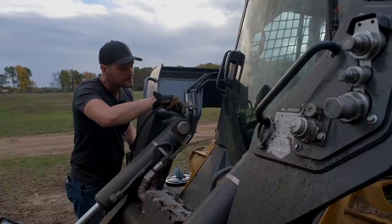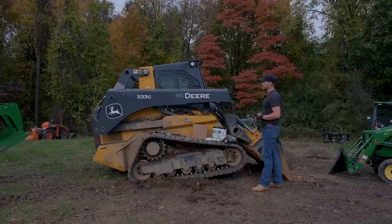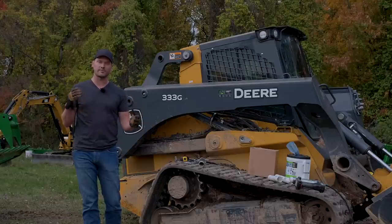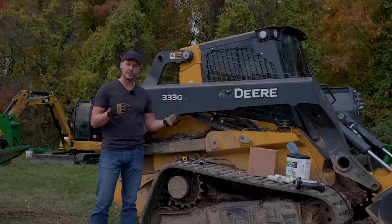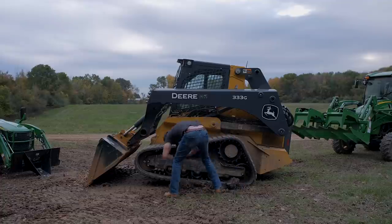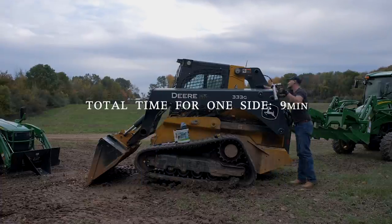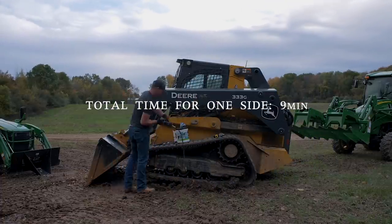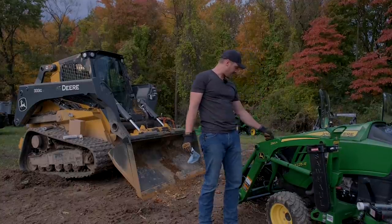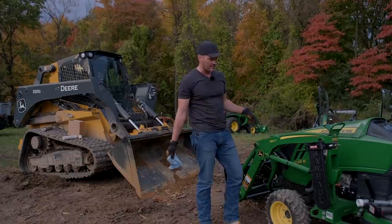Now it's coming out a little bit. We've got one side completely done — going to wipe off the extra grease, clean it up, and do the other side. One great thing about this system is you can switch greases from one type to another; the only downside is losing a little that's in the hose — maybe five to ten pumps to clear it out, but it's a great way to transition. Skid steer is all done. Now we're going to hit the loader on the 1025 — there's six zerks on each side — then get the 4720, and come back for the accessory ones.